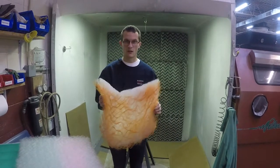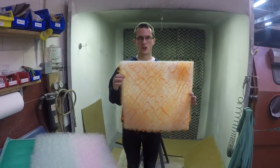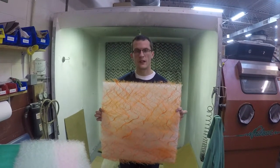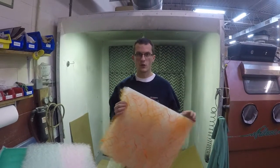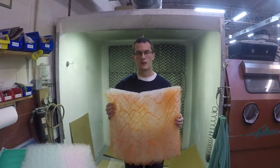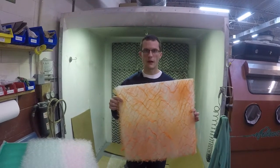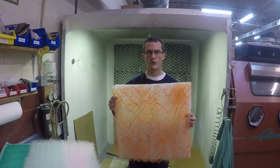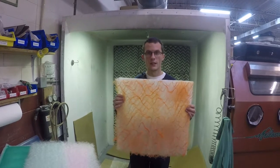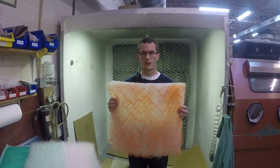These come in rolls as well, so you can use them with a pocket if you wanted, or it'd be even better as just your only filter, but in a blanket style. So for the E28, they're about $105 for 50 of them. So you are spending about $2 per filter. But again, with each increase in the gram or quality of the filter that you choose, you should typically see the life of that filter last about 20 to 50% more. So when you figure that in, if your production time's worth it, it can be worth considering, plus the protection of your fan. So these can be bought in a roll too. Again, they're about $250 depending on the width of roll you select.